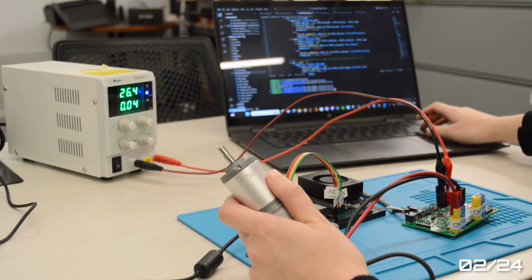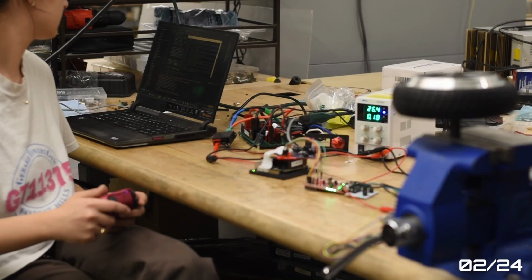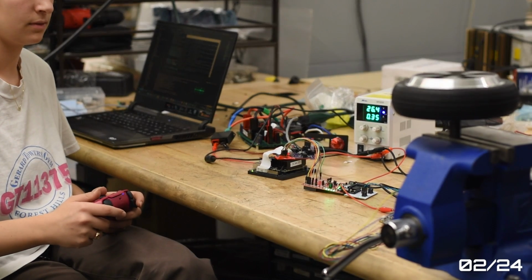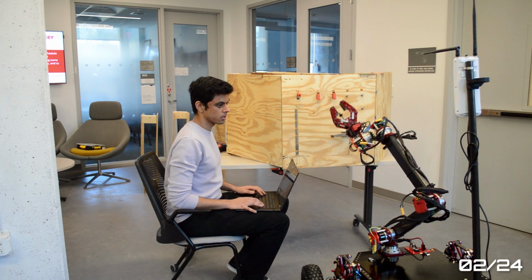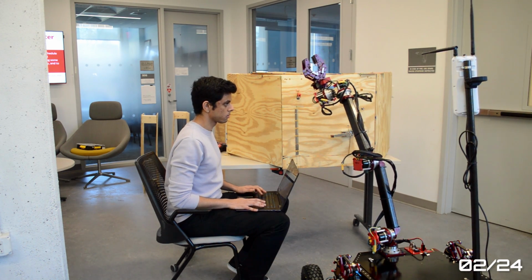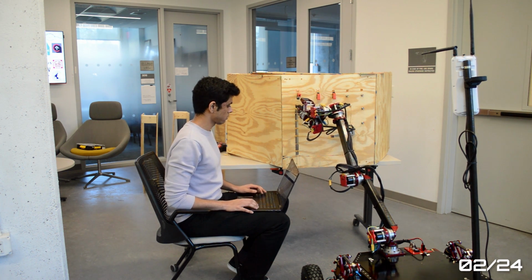Because our system supports a versatile set of hardware, an intelligently designed communication stack is a necessity. Our newly designed central communication system uses numerous layers of communication protocols, including CAN-FD and SPI layers. Additionally, the host software transmits commands through a serial connection. All of these layers have been carefully architected to maximize throughput, allowing for quick feedback and a responsive operating experience.